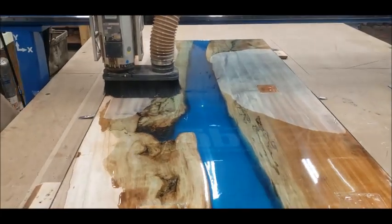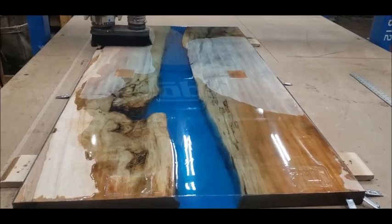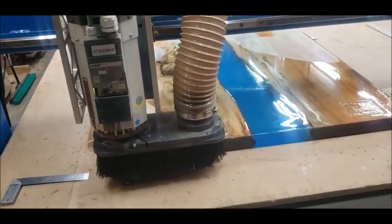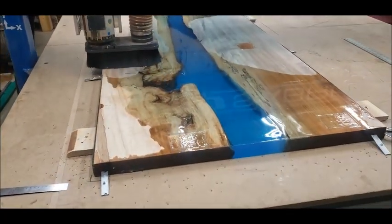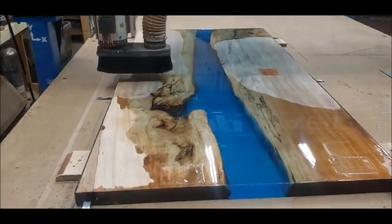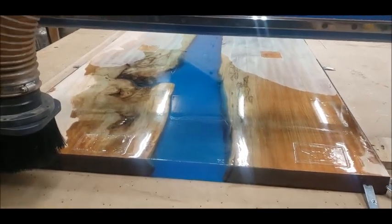Hopefully that makes sense. When you're pouring your river table and massively over-pouring it on the top, you're going to have a better chance of it cupping. Once I do one more pass and most of this excess is removed off the top, the big thing is how much it's going to spring back. I'm trying to keep this table as flat as possible before I flip it over.